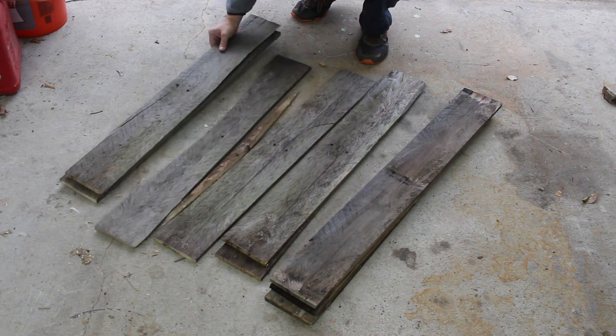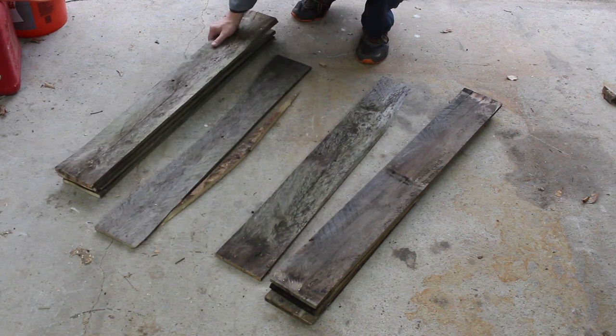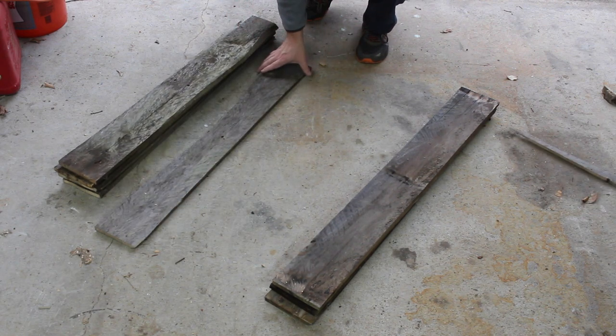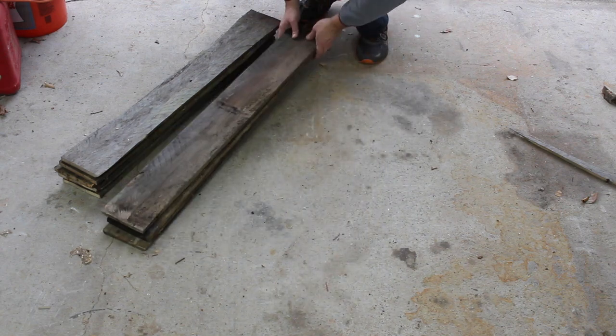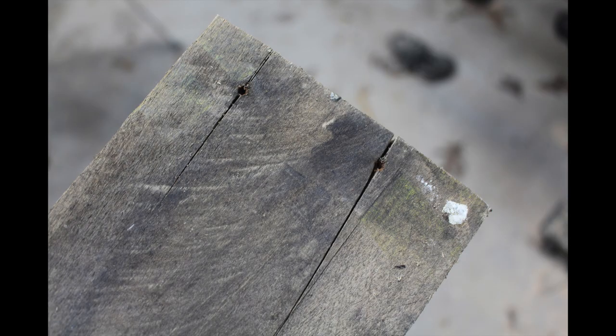Once I've got my boards taken apart, I like to look at them and sort them out — put the best ones that are straight in a pile, then maybe go back with my hand metal detector and mark the places where nails are so that I don't cut into those areas. But don't get too tied up in having perfect boards — these are going to be used for rustic projects, so they don't have to be perfect. I also wanted to share a few challenges with working with pallet boards: they are a very brittle wood that's been sitting out in the sun, so it's easy for them to crack during disassembly or when nailing. I would recommend drilling pilot holes for nails and screws, and I've had pretty good luck with nail guns as well.